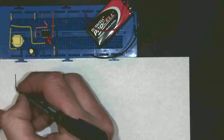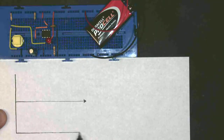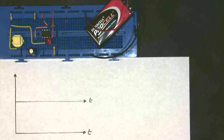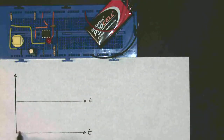Now if I were to draw this on a diagram, I'd have to draw a timing diagram. I'm going to draw my timing diagram freehand. So here is my input line, and here is my output line. These axes are time, and this axis is going to be voltage. So what I'm going to do is have one line for the input and one for the output. The idea is that the output is stable in its off state — at the moment the output is off.